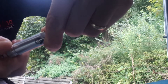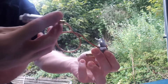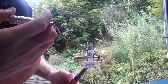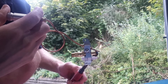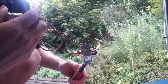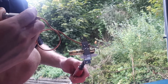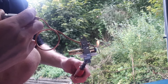Now for the Regan thermocouple tester - a bargain. This thing is just good to confirm whether it is the thermocouple or whether you've got a faulty pilot or something else. It's good for confirmation. You wind the end into the open part of the tester, screw it down to tighten it, and then you want to get a naked flame on the thermocouple - this is on an oxypilot - get the flame on there.